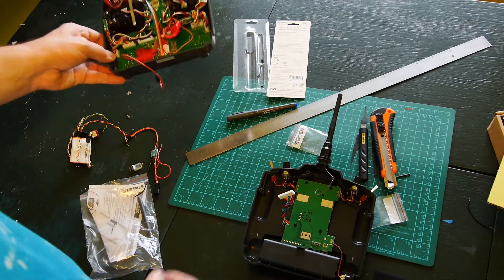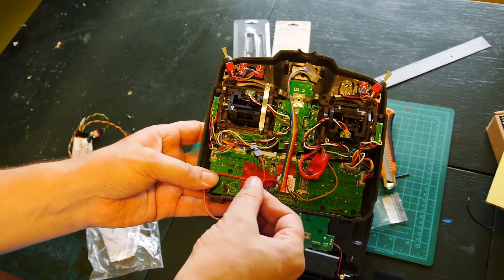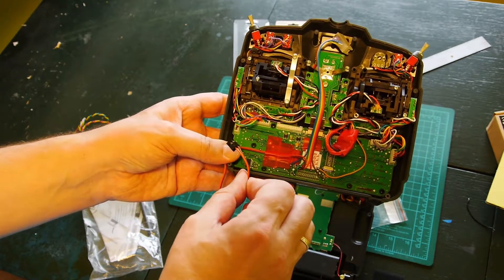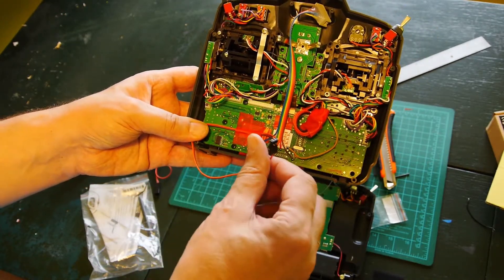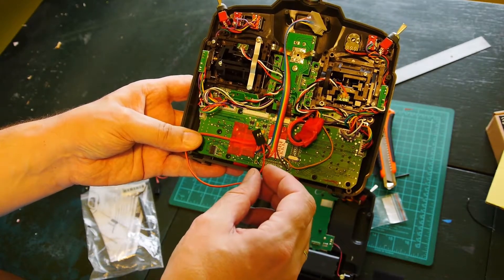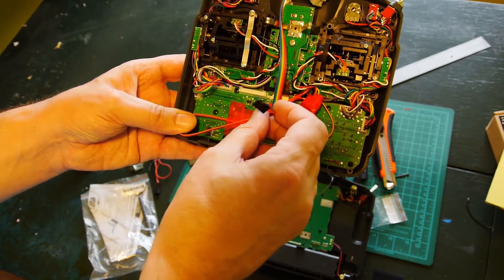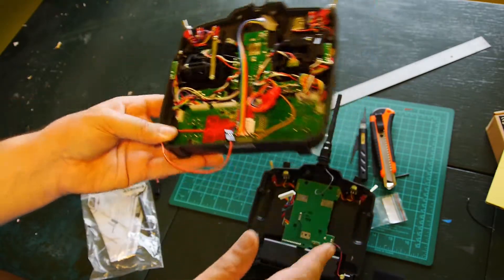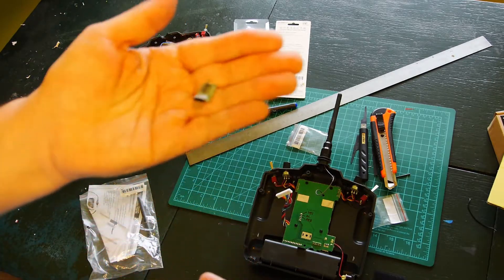The first version of this mod uses this part of the radio above the CPU, with a servo connector, with a male servo connector for RX and TX data. So this first half is completely the same as my previous video. Make this part with instructions from my first video without worry - it's absolutely the same. Here we will use this interface.